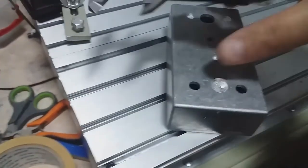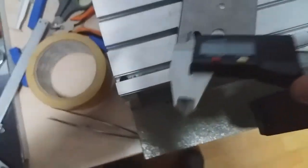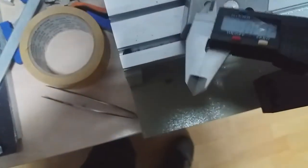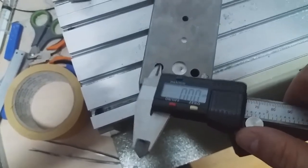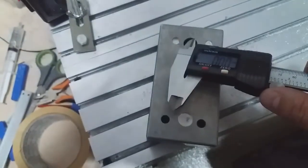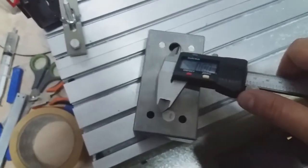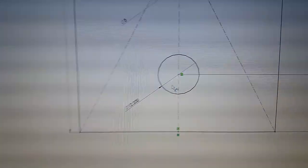The measurements are all according to plan. I decided to make those 7 millimeter holes at about 7.2. This is a 5 millimeter straight and this one is 12.2 if I remember correctly according to the CAD. Let's see — yep, it's 12.2 in diameter, so we're good.